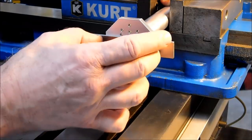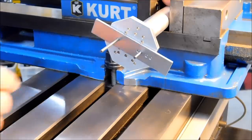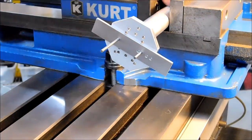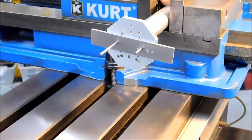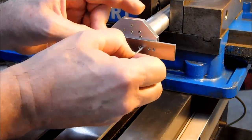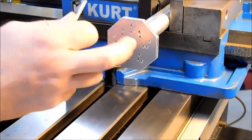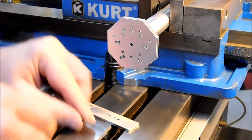You can indicate that, flip it for your 180 option. You can also use the adjustable parallel directly underneath the hex. This does not have to be centered on that, because 45-degree rotation is 45-degree rotation. If the bar is flat at zero and you turn it 45, it's 45 here, it's 45 here — so it really doesn't matter where this plate is on the end of your part. But don't use the plate for axial positioning for that purpose; have something else up your sleeve. One of the questions I received was how do you index a part nine times? You grab a piece of material like this, make a nine-hole bolt circle, and do exactly what I'm doing here. Use pins, use a cheater bar, off you go.